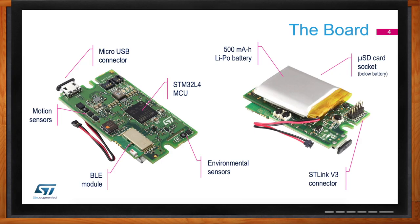So can someone reprogram the available microcontroller? Yes, you can, because the board includes the ST-Link V3 connector for debugging and reprogramming. In pro mode, usually is when you use this functionality. Additionally, the user can set the board in DFU mode — Device Firmware Upgrade — which allows the user either to command through the mobile app or by pressing a couple of buttons on the inside of the Sensor Tile Box to put the board in Firmware Upgrade mode. This allows the user to update the firmware according to their needs — it could be a custom firmware or a different example provided by the Function Pack.